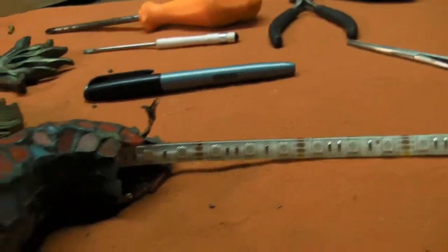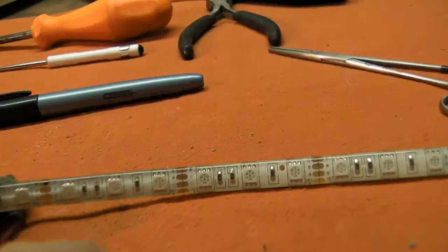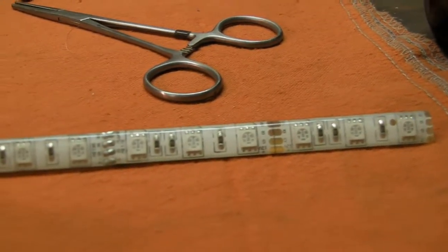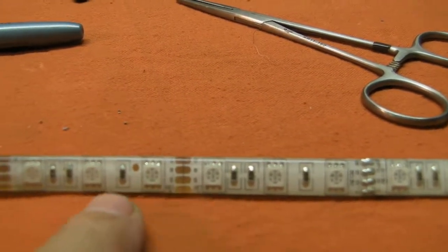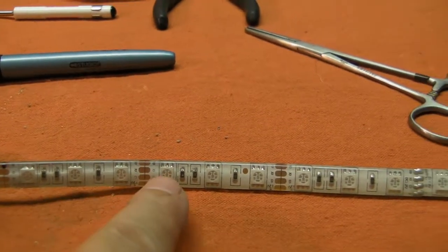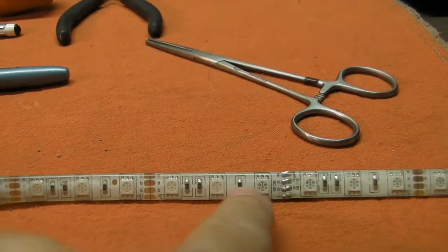I've marked off the LED strip — I have it kind of run along in there at the moment, and marked off where I think it'll sit half decent. With these LED strips, they can be cut to measure. There are little cut spots, and that's the only spot on the lines that you can cut. You can't cut in between, or you'll cut the circuit for whatever lights are there.